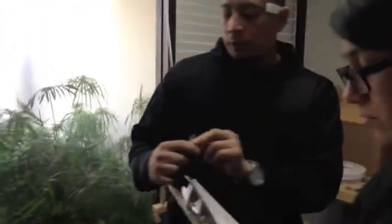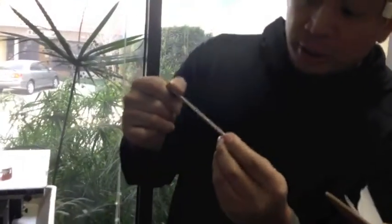Step 2, set the tool. So with a piece of metal, you're going to use the NRD, right? Non-rotating diamond. The 120 right here talks about the angle of the diamond on the bottom. So any metal that you're going to use, you're typically using a non-rotating diamond. And it's just a scribe technique like you've been doing. But the angle of the diamond is 120 degrees on the bottom, and it should say that here, 120 degrees. Oh, okay. That's how you know it's a non-rotating diamond.